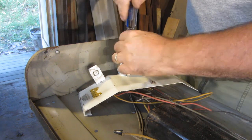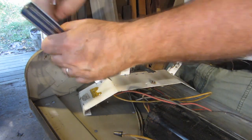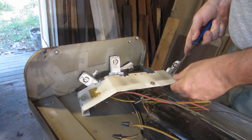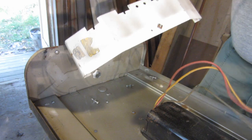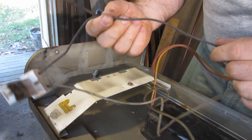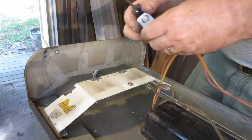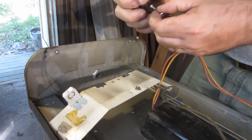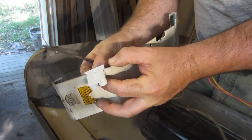I'm going to take all of the old ones out right away while I'm here. When I was looking at it, all of this old wiring is cloth-covered, and I just didn't want to put any more into the old technology. The new tombstones have a very similar setup. We're going to put this one in — it clicks in. This is kind of like belt and suspenders because you've got the clips holding it in place, but we're going to put these nuts on here anyway.